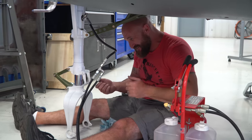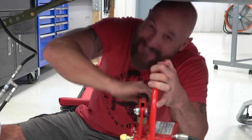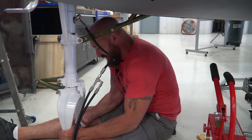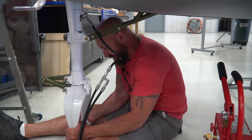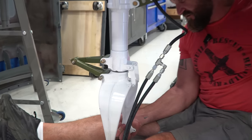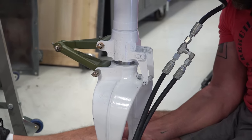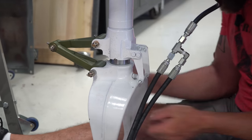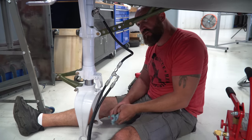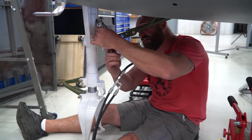It's hard to hold it up and pump at the same time. I think we have all the air out and right now it is just hydraulic pressure. I'm going to give it that quarter-inch clearance, then let it go because it's hurting my hand. I think we're good as far as hydraulic pressure goes — go ahead and tighten this valve up.